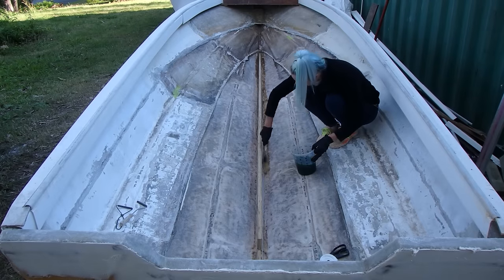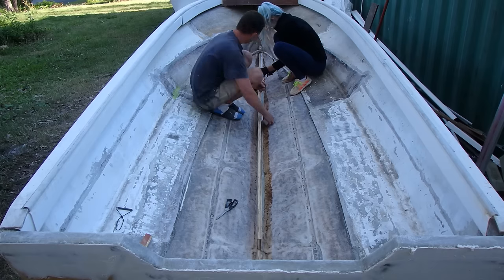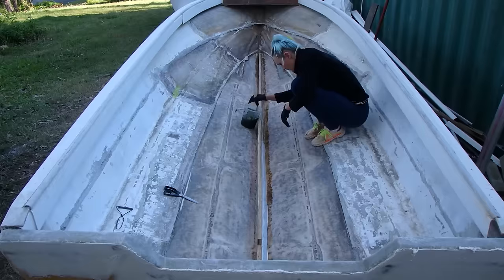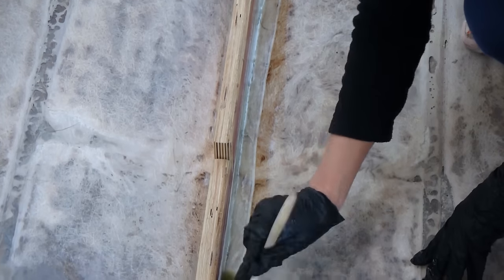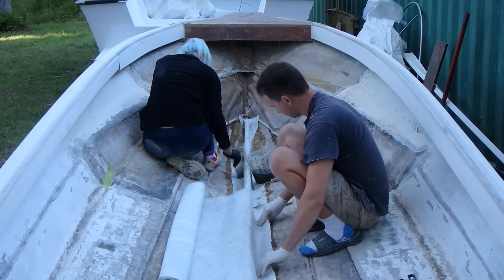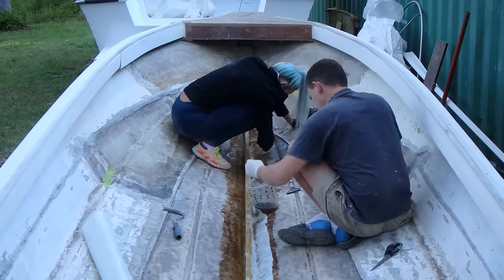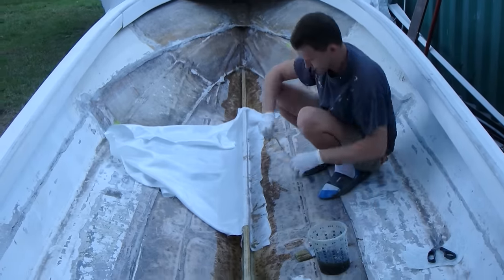We used taping fiberglass for the first coat, which is about 3 inches wide and a little bit easier to use in this first application. Next, a layer of 300 gram chop was cut to size, laid up over and down the sides of the keel, stretching past about 3 inches. The final layer of fiberglass to place on the keel was a layer of fiberglass cloth.